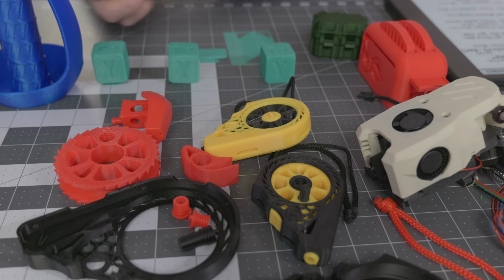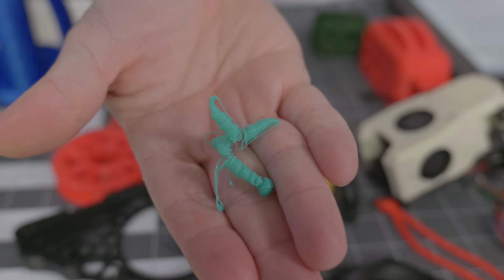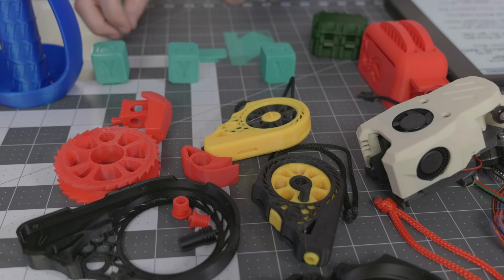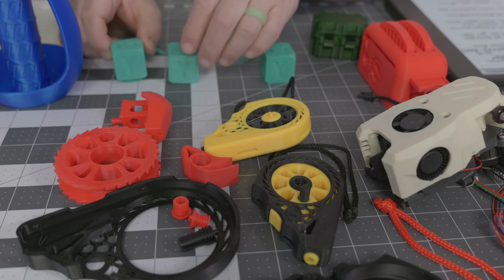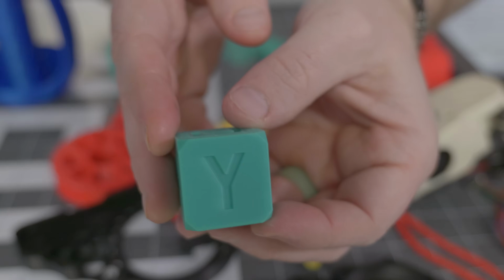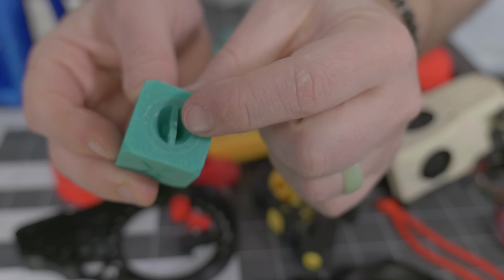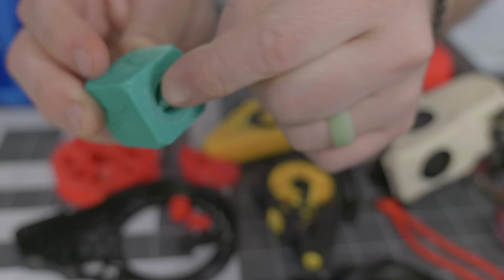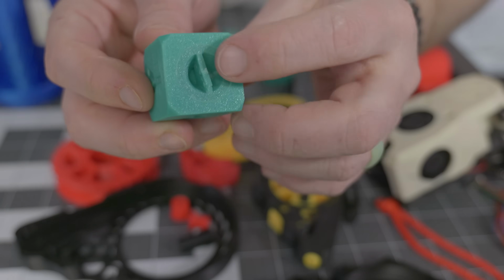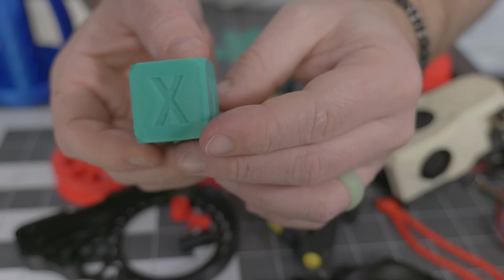So what I did was I went back into Klipper and we did rotation distance first. Got a couple blobs here, made sure that it's rotating how it needs, and printed another one right away. Right off the bat, we definitely got a better result. There was less filament coming out, obviously, so I was able to get this guy in there, although that's in there forever. If I try to take that out of there, it's broken. However, as you could tell, just in general, we got a better result.